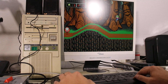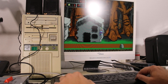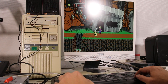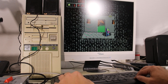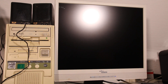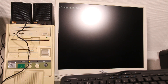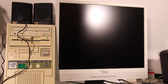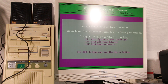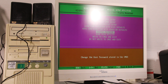On the 386, Commander Keen can show how well it can deal with USB keyboards. But on the 386 we also get the colorful AMI BIOS, which supports setting the keyboard typematic rate. This defines the behavior of the first and following repeats when a key is kept pressed. The parameters are set in the BIOS and sent via host-to-device command to the keyboard — or in our case to the RetroArdo input — which is then responsible to deliver the right repeat rates.